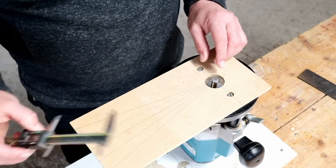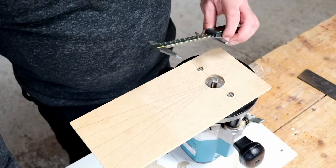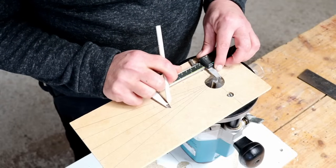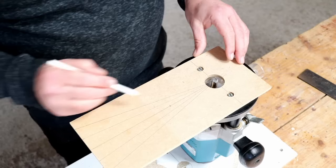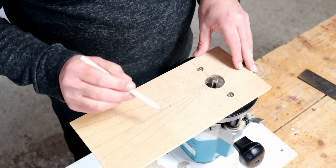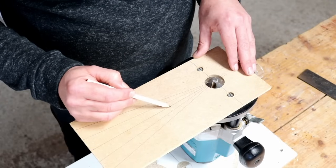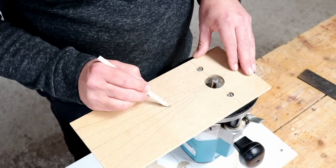Now I know that the hole I need to make for the template is 208 millimeters. So half of 208 is 104. So you just measure from the outside of the bit down 104, like that. So I'll bore a little pilot hole there now to allow a screw to go into the piece, and that'll be perfect. But the reason for all these lines is that if you have that one there in your centre and you're out by a millimetre or 1.5 millimetres, you're not going to be able to put another hole beside that one, because it'll still be the same.